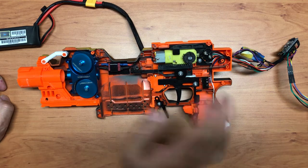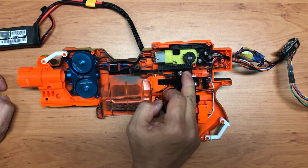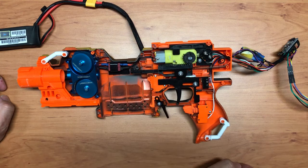So what I did was write the program such that there is another subroutine where you always check whether the pusher is back in its position when it's supposed to be. After a certain threshold, in terms of milliseconds, if it detects it is supposed to be back but is not, that procedure kicks in, and you fire off the mechanism and make sure it pushes off slightly and returns.